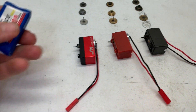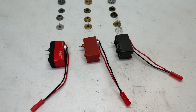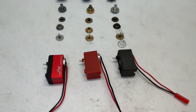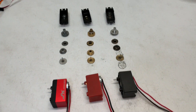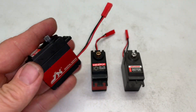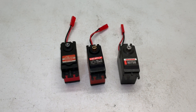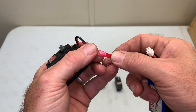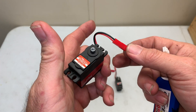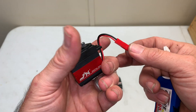I run each motor already with this little 2S and they all sound perfectly fine. I highly recommend you give the motor a good test to make sure everything is good to go before you start reassembling the gear train. When you get everything back together, you'll have a servo winch — simple as that. Here's the JX. Keep in mind these servos were never meant for this, so a little added noise is just fine. You won't notice it while you're winching up something.